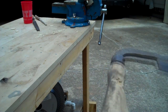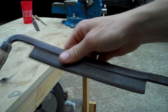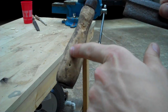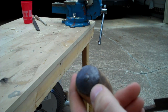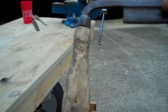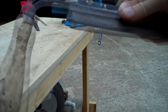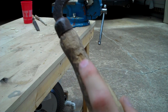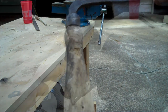It's not as good as I'd like for the handles, so we're going to go ahead and actually take this thing fully apart. I wasn't planning on doing that, but after looking at it, it's just going to need it. Basically the way they do these is it's a rat tail that runs down through the handle, and there's a small little washer here and what looks like a little pin nail is actually the bottom of the rat tail that's been mushroomed over. So basically all we have to do is grind that off and this whole thing will come apart, and we'll put a nice set of probably oak handles here if I can find something even nicer. Because I feel like it deserves it — you can see there's just big gouges taken out of it and it's all dried up and falling apart.